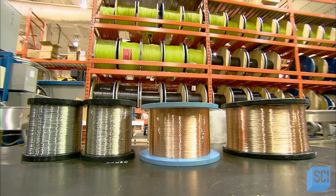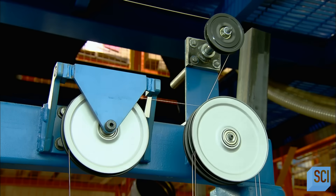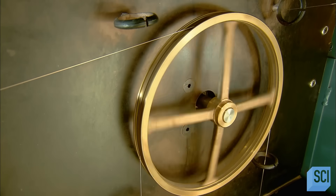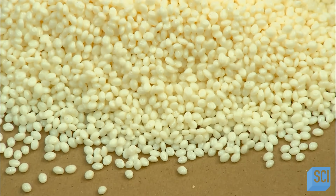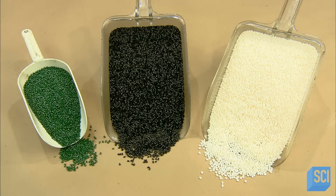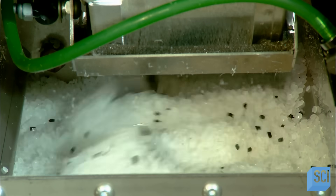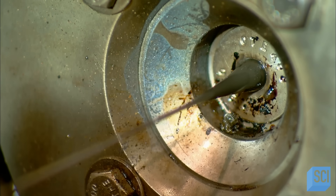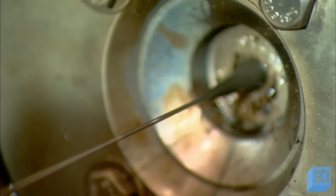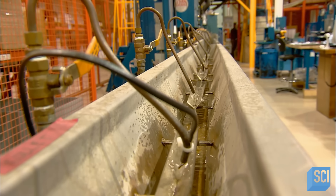At the core of those electric heating cables are copper or copper alloy wires called conductors. An unwinding system feeds each spool of conductor to an extrusion machine. Extrusion machines force molten plastic through a die to form a particular shape. They load the raw plastic pellets into a receptacle called a hopper at the top of the machine. The pellets drop into a heating device that liquefies them, and the machine forces the molten plastic through a round die, forming a plastic jacket around the conductor. A water bath then cools the still-warm plastic to prevent sticking as they wind up the conductor on a spool.